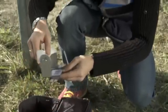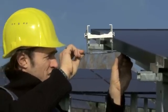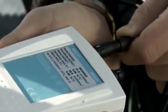First of all, connect and fasten the irradiation and temperature sensor. Fasten the metal bracket to the modules being tested. Then connect the connection cable to the irradiation and temperature sensor, selecting the correct output according to module type.